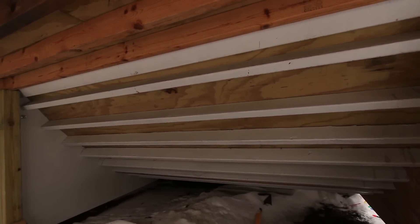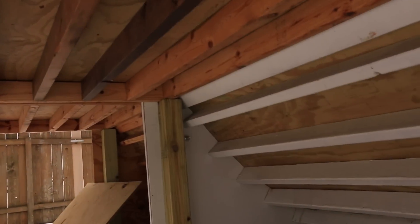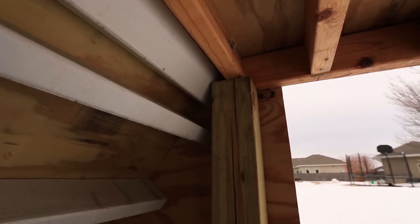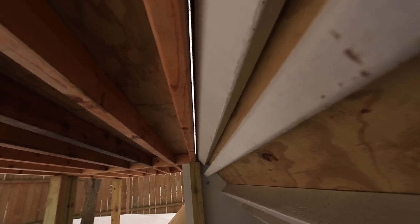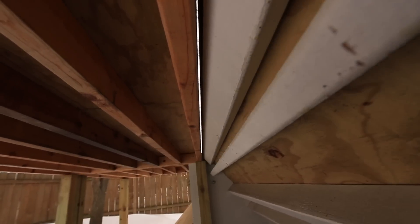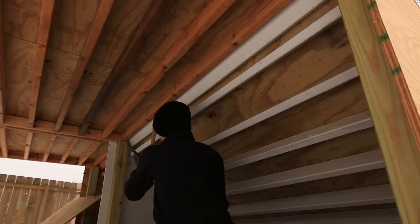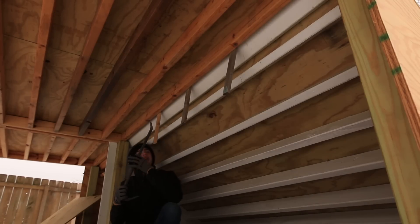That's going to be interesting. Over there you can see the supports for the top surface. I was planning to just stretch a two-by-four all the way across there on the strong side, perpendicular to the one currently. But that doesn't look like it'll work because a two-by-four can't fit right here — this is in the way. This is bowing inwards around here, it needs to be pressed back out. I wonder if I could put shims right here and then use this to help brace it. After a little bit of messing with it, I think I got it pretty flat all the way across.